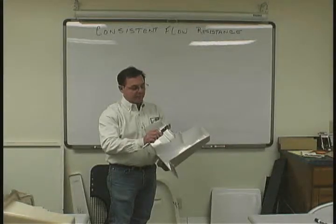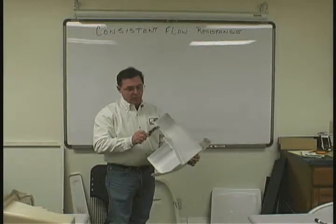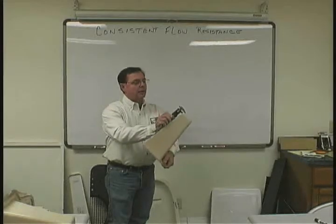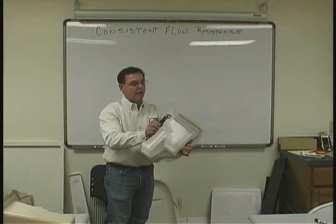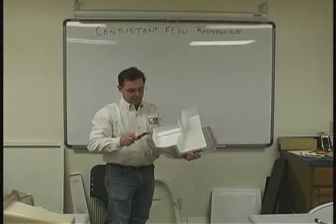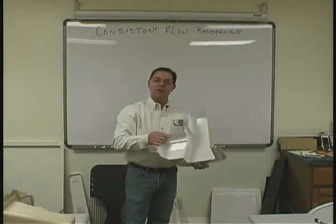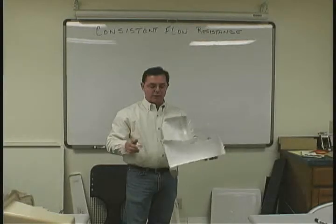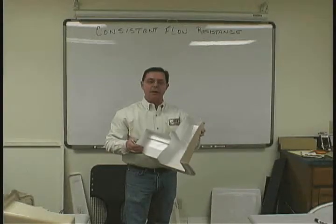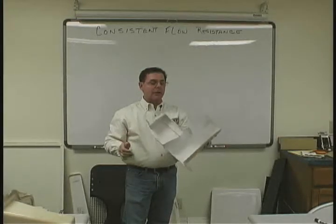There is a little bit on the thick side right there — we're measuring in at 131, so we're a few thou over that. Here we're at 125, 119, 121, 129, 127. The point is we're holding the laminate thickness within just a few thousandths of an inch. Open mold never could even begin to achieve that — at least not with production-ready operators doing this day in, day out. Careful manual time-proving could technically be done by hand, but in production it would never be that accurate.